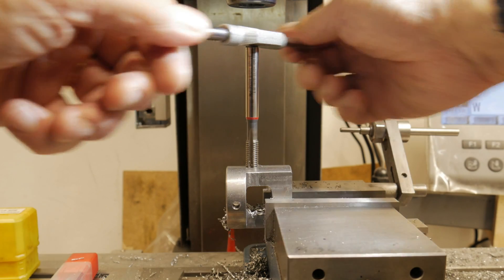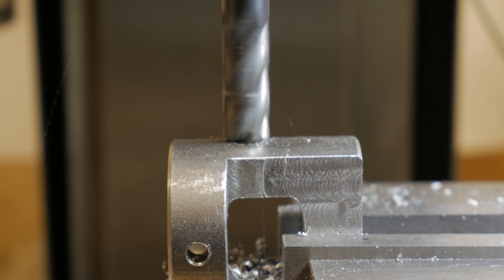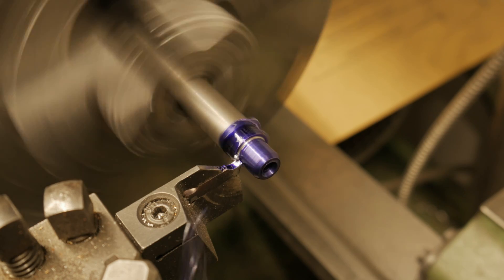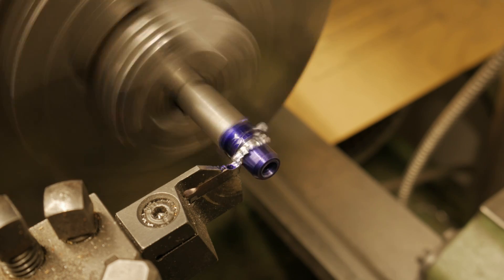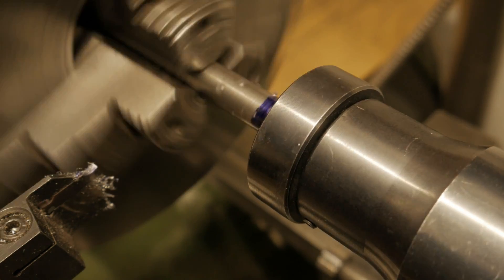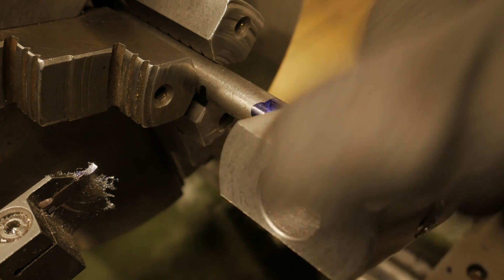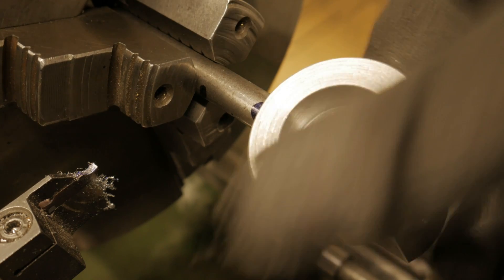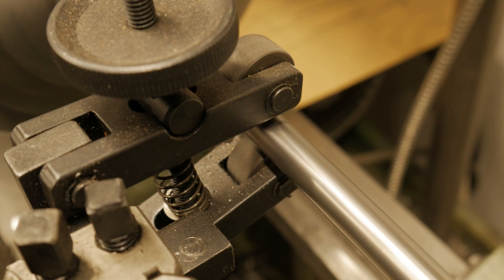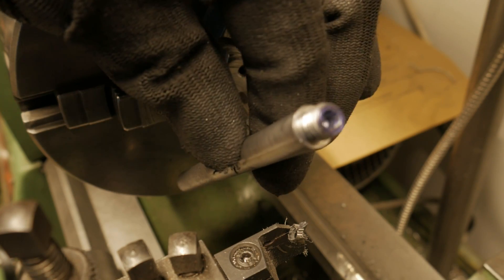That little trick is very useful for making a thread in steel — I have seen it done so I decided to apply it here. To be sure that all the thread of the handles abutted, I added a small relief at the end of the thread. By screwing in the central support this stopped perfectly, so the thread was constructed in the most correct way possible. The original design didn't provide knurling, but I love it and couldn't resist the temptation.